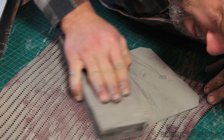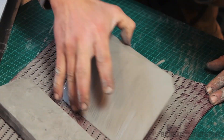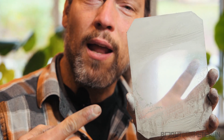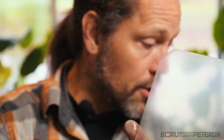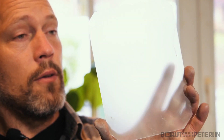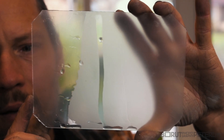The trick I forgot: when you do this and you wipe it, you can see everything behind — this is not good. There's one important trick: don't evaluate your ground glass wet, you have to dry it. This took me like two days to figure out. See, this is how it looks wet — it's very transparent, not good enough for ground glass. You have to dry it. Look — half wet, half dry — totally different.